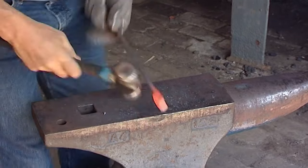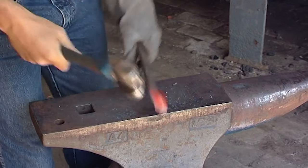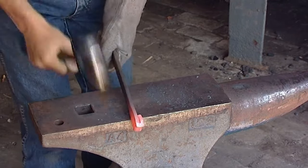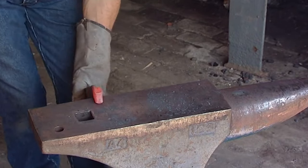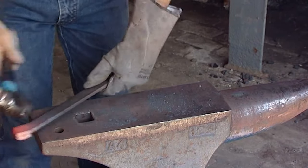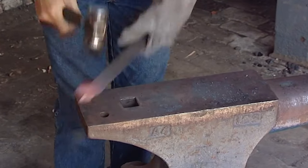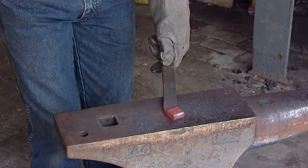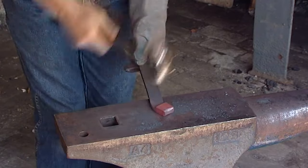Alan is now showing you how to make the outside heel. You can flick this over and weld it if you wish, but really it serves no purpose. Alan's flicked it over, welded it, and now he's setting it — checking it away from the frog. Usually you would make the heel square, the same width of material turned over so you'd get a corresponding cube.